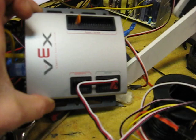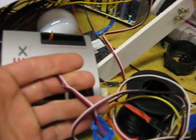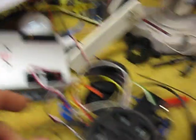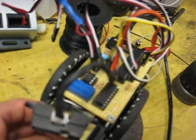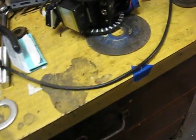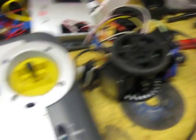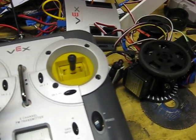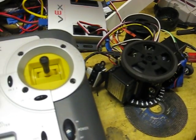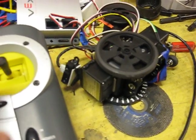For all intents and purposes, this is just a model airplane receiver with standard servo outputs. I've tied the data line and the ground together into just a regular digital input on my PICAXE, and using the pulse-in command, that turns into a word value or variable. In this case, it's spitting out between 0 and 255, which is kind of convenient — it sticks into a word variable, and then I've got that word variable stuck into my pulse width modulation code.